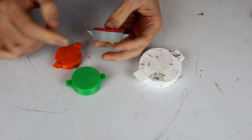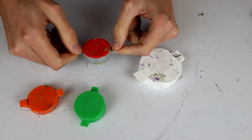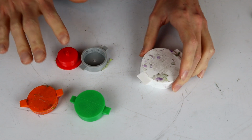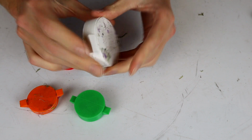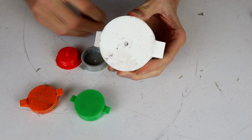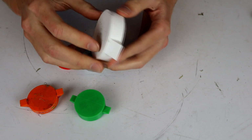The other features of this mold, it's got 2 little wings on the side, which are there to grab hold of and then push down to release the middle section of the mold. Now this stuff works okay, except for after repeated use. These are a little bit grotty because they have been used a lot. These are just PLA, and you can see that when the silicone cures, you can literally just peel this stuff off. So that's why I don't use any mold release or anything, because I don't really need it.